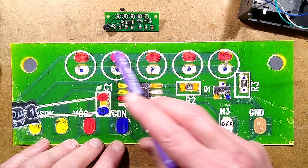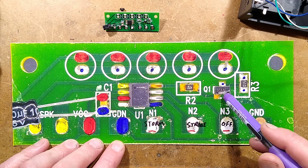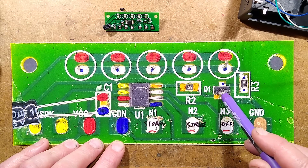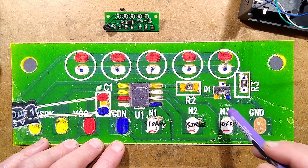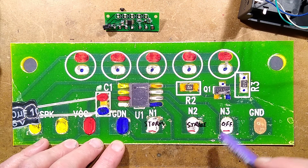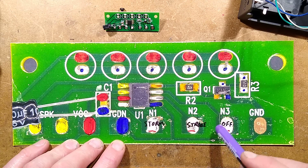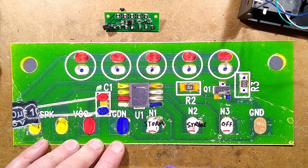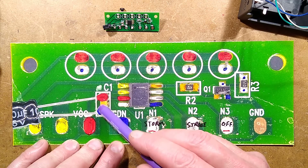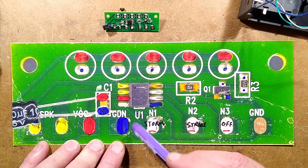Here's the circuitry. There are five LEDs in parallel and they are controlled via a little MOSFET. Interestingly, the MOSFET is an OOA8C, which is equivalent to an HX2300. Why didn't they just write HX2300 on that? There's a 51-ohm resistor to limit the current through the LEDs — it switches to the negative rail. There's a little ceramic capacitor here, but they've bodged a 100-microfarad electrolytic capacitor across it. Presumably there were processor stability issues for whatever this mysterious chip is.